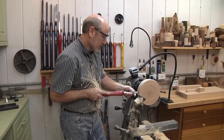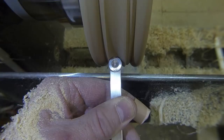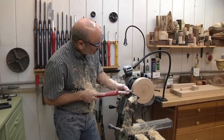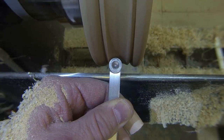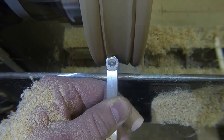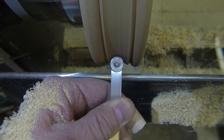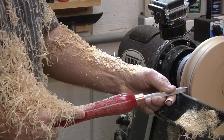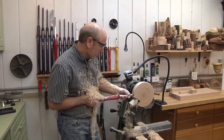You have to move some wood to start with so there'll be a little noise. Coming out this way now. I've got a ways to go down since there's a line way down in there, so we need to bring out a lot of wood. Make a light cut when you do this — if you take a big cut you'll tear the grain out, and you don't want to be sanding all day. That's looking really, really nice. I'm going to sand all this up and then we're going to go over to the drill press.